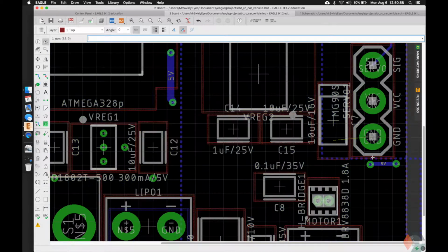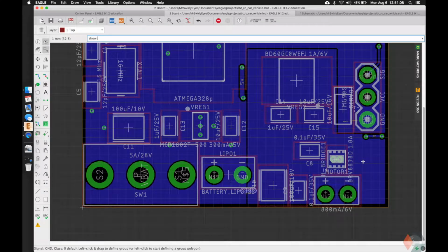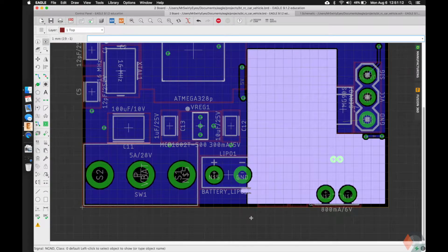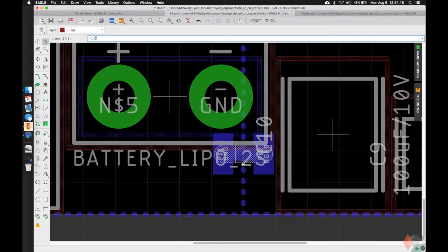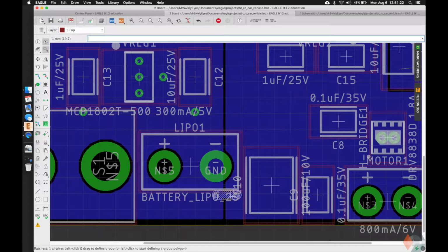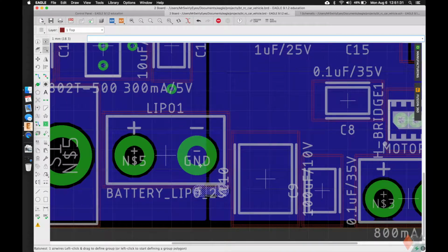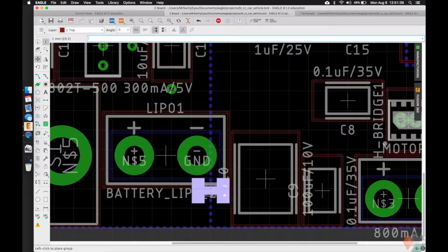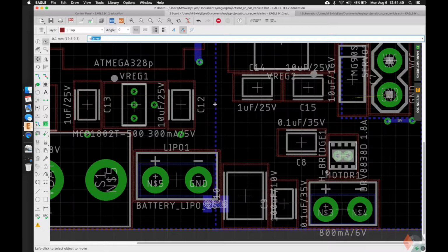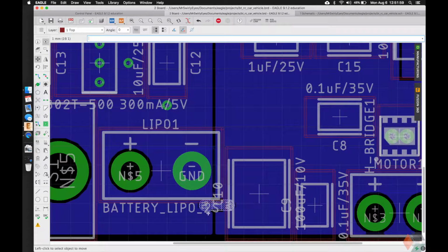You can also take advantage of this via and use it in our favor, such that we can just maximize the room we can take up there. That looks good. So our noisy ground, nice and continuous, and if you notice, it connects to our net bridge right here, perfectly in the center, and our ground is here. So we can see this is exactly where the noisy ground is going to hit our regular ground, and then it'll make an immediate connection into our battery, which is exactly what we want out of it. Just to make it so we don't interfere with the pad a little bit, I'll slide this over a tad. Yep, that looks good. So again, it'll connect through here and run straight into the ground.